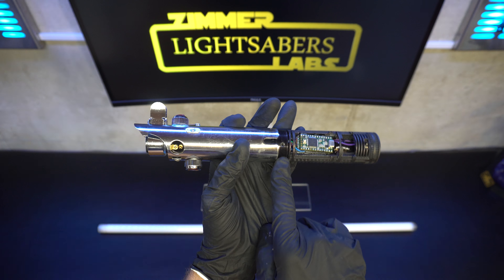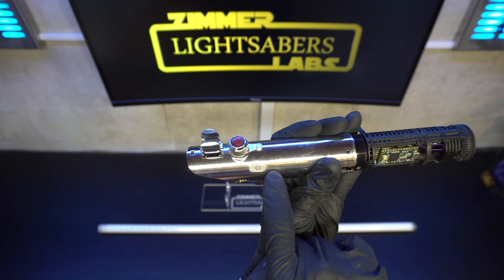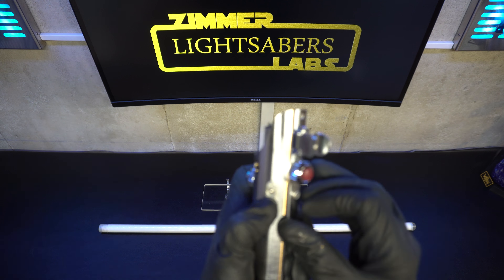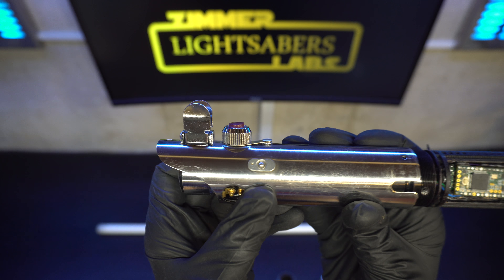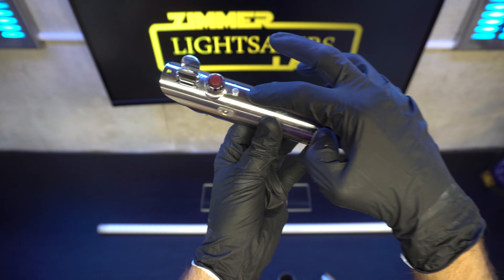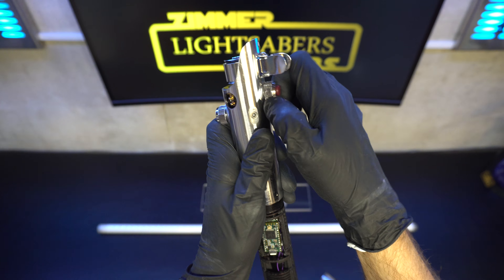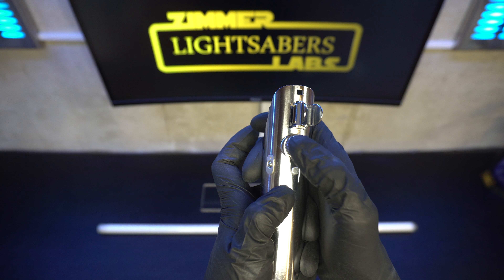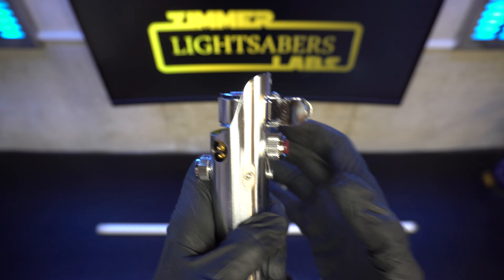The Custom Sabershop one inch blade holder also has a corresponding button and slide switch tab, which is just a press fit — you just press it in there, but it gives you a nice option for an auxiliary button. So that's what the auxiliary button is now. The switch wires can also be routed up through the blade holder so they come out right about here. Your red button activation has really good action on it.